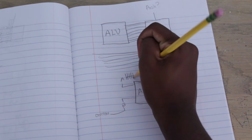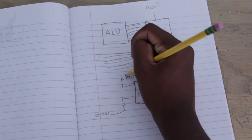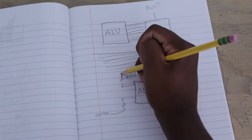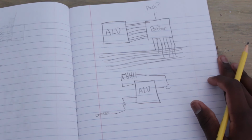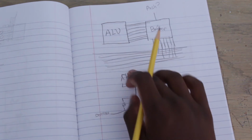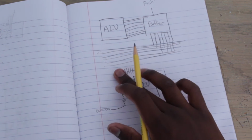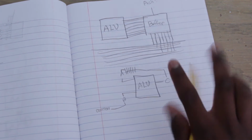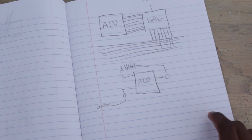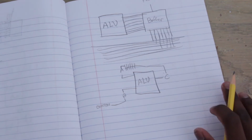originally. Let's just call that the bus. And then A is connected to the bus. And then we have the little switch on register A that we created in the last video that says whether we want to load from the bus. Once we load, the value will go into A, and then it'll calculate. Then we can load again and calculate. This way, every single time I press the load button on the A register, it's going to plus 1 to the value. And then I press again, it will plus 1 to the value every single time.